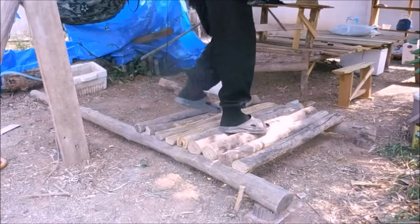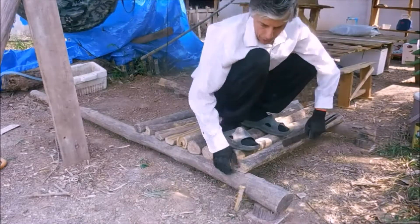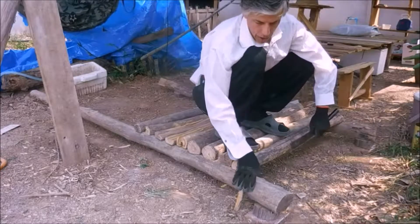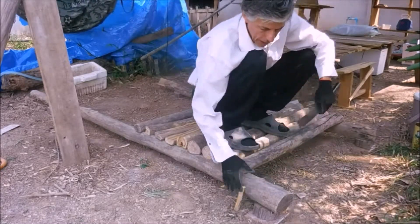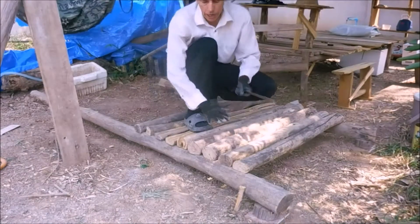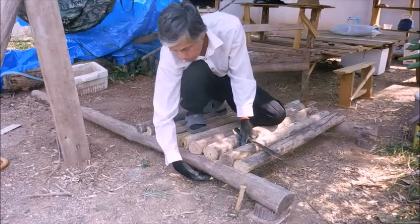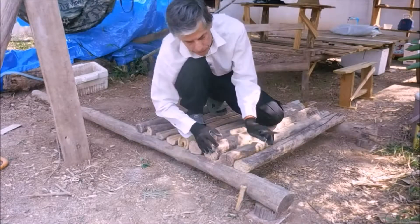There it is — it's all done. A final touch might be to put two stakes on both sides at the ends of these support beams just to stop them from rolling and make it a bit more stable. I've now got a floor, I'm up off the ground, and with the stumps you can see I've got a nice gap between the support beam and the ground. I can now inspect for termites.